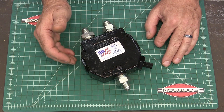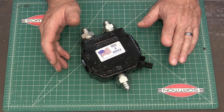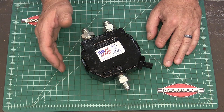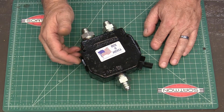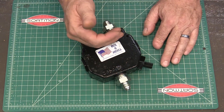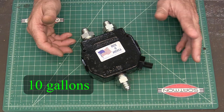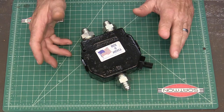When I installed it, I noticed that with the RPMs of the tractor all the way up, my valve was getting hot. I looked into it and my tractor puts out almost 10 gallons per minute. What I wasn't thinking about was it's not about how much volume you need to send to your cylinders — it's how much volume can pass through the valve. My tractor has an open hydraulic system, so all of that flow has to pass through a valve that's really only supposed to handle eight, which causes heat.